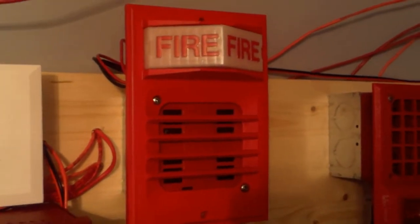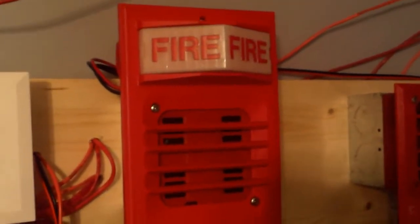The system test was requested by Vintage Fire Alarm Guy. For NAC 1, he requested the Simplex 2901-9838 behind the 2903-9101. And over here, NAC 2, he requested the Federal Signal 450D behind the Space Age AV32. Both of these devices are doing four-wire operation, and the light on the Space Age AV32 will just be flashing steady.